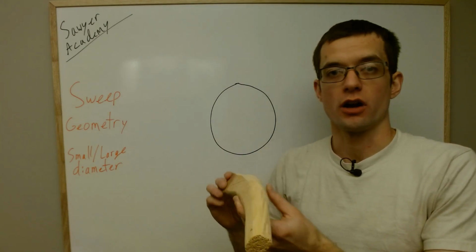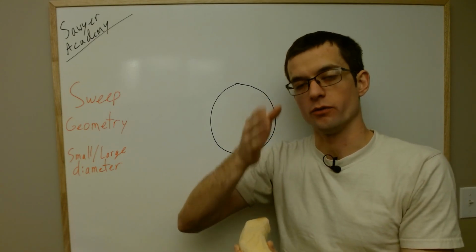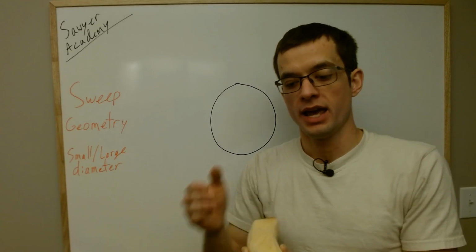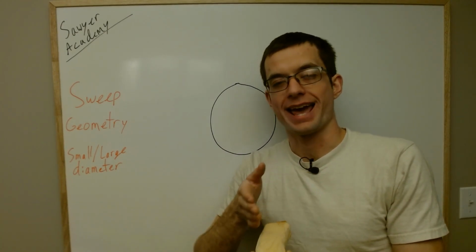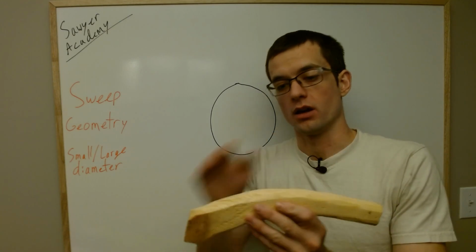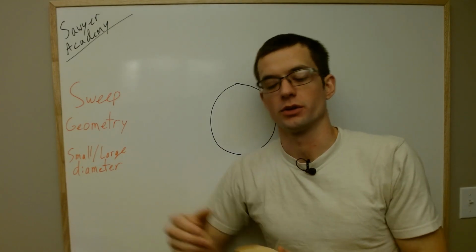If we were to start our face one with, let's say, the belly or the horns, you would have to take a significant number of more cuts off each of those faces to get down to a cant size that was the full length of a log. And if a log has enough sweep, you would never be able to make a cant size the same length as your log. So if you had a 16-foot log with a lot of sweep, if you start with your horns or your belly, you will never make a cant size because you'll literally just cut through the whole log.